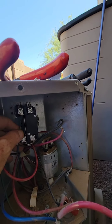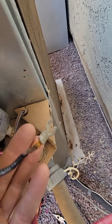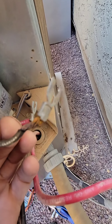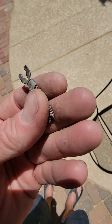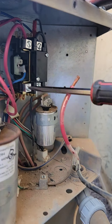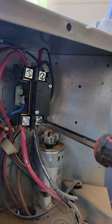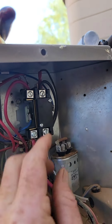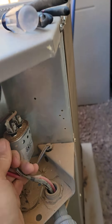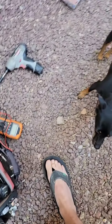The thermostat or controller is what does the low voltage control, and it's likely been doing this for a little bit. I'll cut this back — the overheated wire can get pretty brittle, so I like to cut out that bad section. If I can get this to work, Ace really might be the helpful hardware place, especially on a Sunday. Everything looks pretty good.